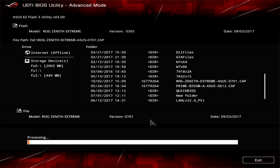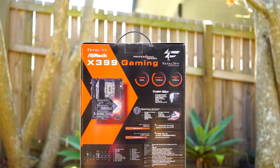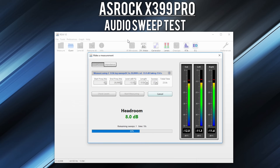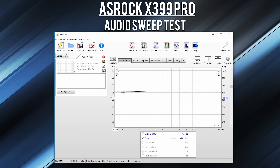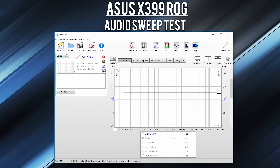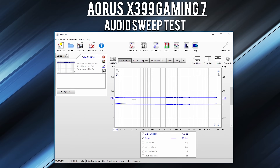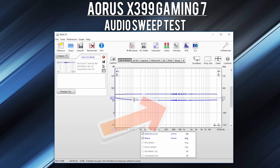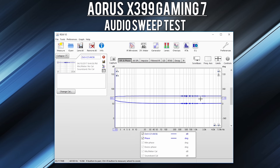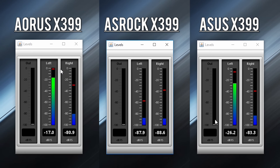All three motherboard manufacturers advertise audio very strongly. On the ASUS and ASRock motherboards, the frequency response was exceptional — very close to being perfectly flat, which is what you want for video editing. The Gigabyte Aorus Gaming 7 had a bump with a strange line from around 200 Hz to 2K, where voices would be emphasized — I'd like to see that rectified. However, when it came to crosstalk levels, which really makes the audio experience great especially with headphones, all three scored really well with extremely low crosstalk levels.